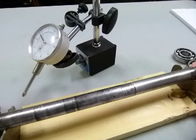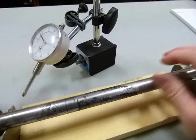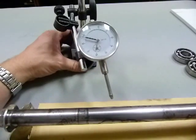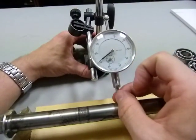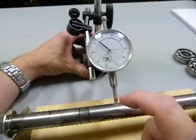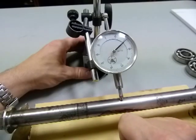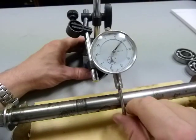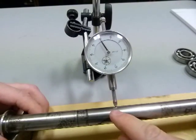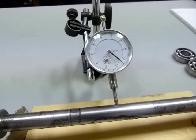This way, when I rotate the axle — you can see it is indeed rotating, that's why I chose an axle with staining on it, so you can see its rotation. What you need to do is grab your dial gauge and set it up so the probe is square to the surface of the axle or the piece you are measuring. If it's off, it's going to slip off. It needs to be square both ways — square also this way, preferably.